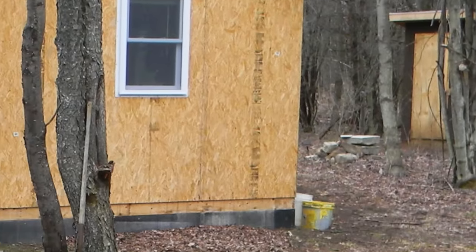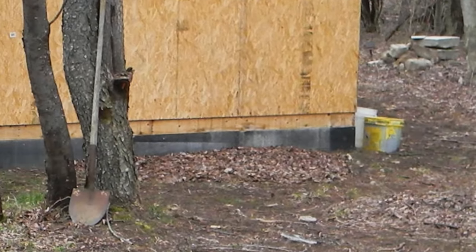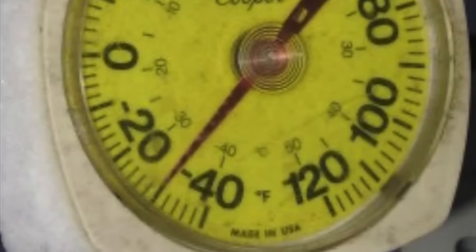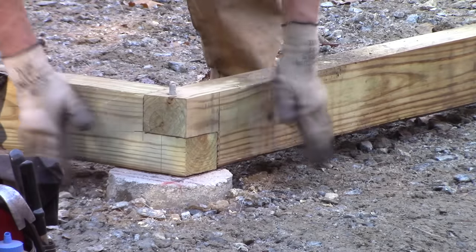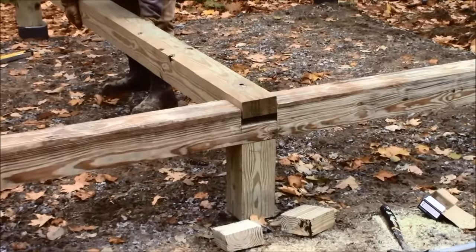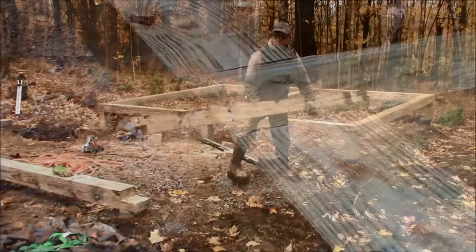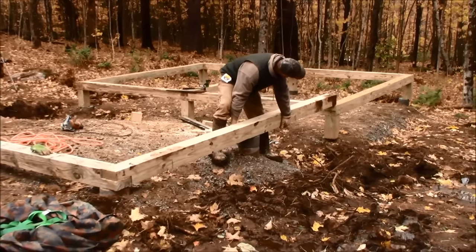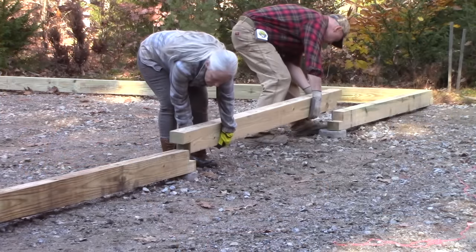This is how I have it at my New York cabin, but with a layer of bubble foil behind it. It has experienced temps of minus 30 and suffered no damage from frost. When I'm pouring my piers I bring them just above the surface of the ground and build up from there. Here I've added wooden posts and will frame between them later on and apply skirting around the perimeter. The posts make it easier for applying the framework and skirting than if I had poured the concrete to this height.